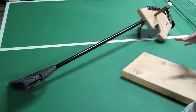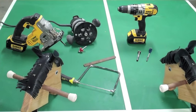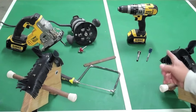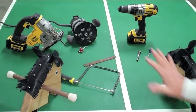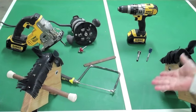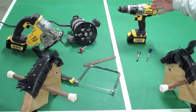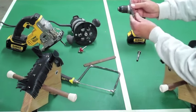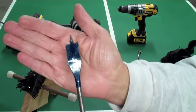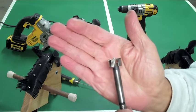Let's go into the construction now that you know the materials. Now let's take a look at some of the tools you'll need. There's the poor man's way of doing this, and then if you can afford and have the tools, there's the faster, easier way to do it. You'll need an electric drill. A drill press works even better. You can use either a three-quarter inch spade bit, or I prefer using a three-quarter inch Forstner bit.